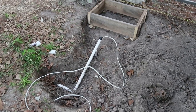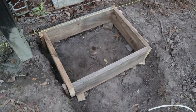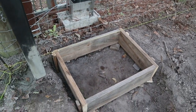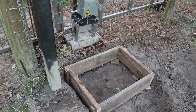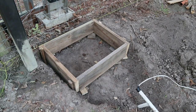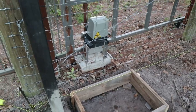I've got my electrical here — I've already disconnected it because it was previously run underneath the box I'm building for the motor pad. Like I said, it's 28 by 24, going to be 8 to 10 inches deep. It might be overkill, but I'm not going through this again. I plan on running about six to six-and-a-half 80-pound bags of concrete, and I'm also going to drive steel into the ground in four spots and add rebar and chicken wire to reinforce it.